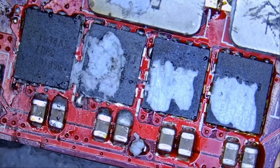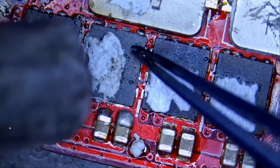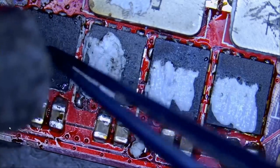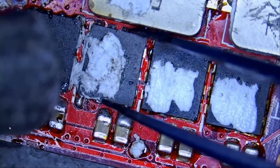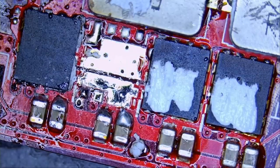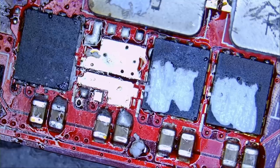Let me go over the MOSFET that we replaced yesterday — I'm going to remove it and see if that will release our short. We do not want to replace this MOSFET and try the laptop again because this MOSFET is going to end up shorting out again. We're going to follow Michael's suggestion and replace both MOSFETs. That may or may not fix the problem. Let's get rid of this MOSFET and measure again to see if we still have a short — just like we did yesterday, by removing the MOSFET we got rid of the short, and we assumed the rest of the MOSFETs were good.